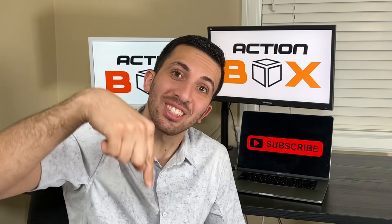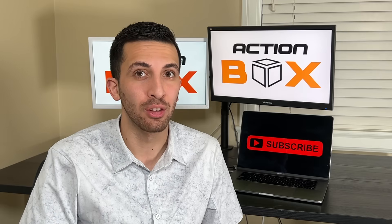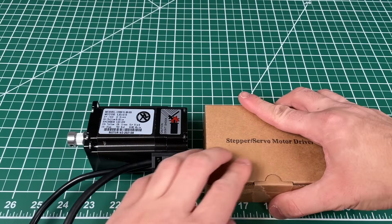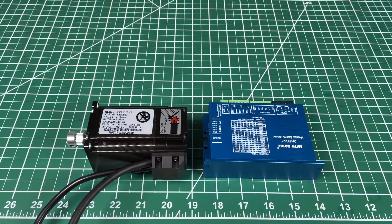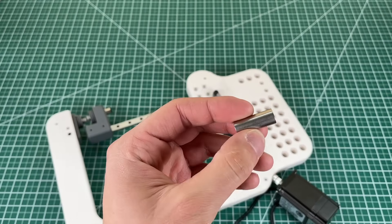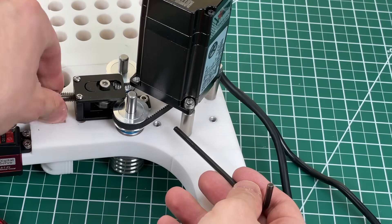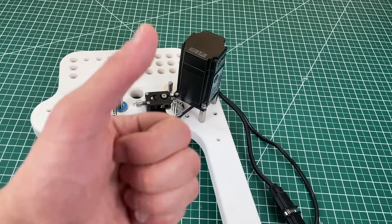Please hit that subscribe button below — we don't want you missing any similar videos we're going to be launching in the future. Now let's turn this around and install the stepper motor. We're using a conventional closed-loop NEMA 23 stepper motor and the driver that came with it — the set was about $120 US on Amazon. Mounting is easy: we just slide the motor shaft into the timing belt and use stainless steel spacers and screws to install the motor into its intended spot on the frame. The motor is in place but the belt is a little loose, so we employ our belt tensioner to make sure the belt doesn't slip over the teeth of the gears.